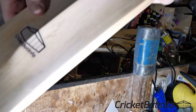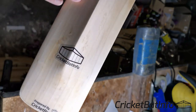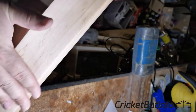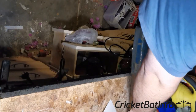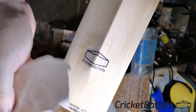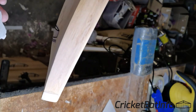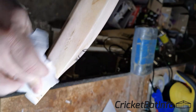I have finished doing what I promised — steaming that dent out. You can see a little bit of it under the shadow, and I did get a little bit of glue in there. The last part — I couldn't get these dents here out as they're quite deep, but I did get most of the dents out along the spine. It just needs a polish. As far as the finish, I did find that the Magic Eraser didn't leave the bat really smooth, so I actually went over it with some 400 sandpaper, just to smooth it out a little and give it a nice smooth finish. Particularly with steaming, it does lift the fibres a tiny little bit. You can obviously go over some areas if you think you can get more of the redness out, but the sandpaper is far more abrasive than what the Magic Eraser is.